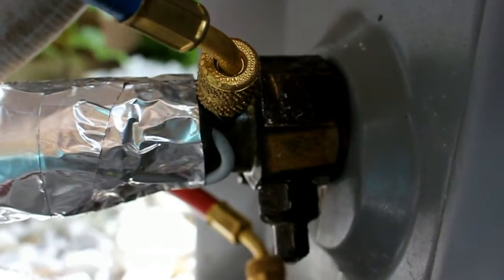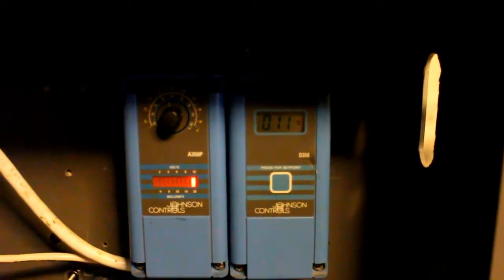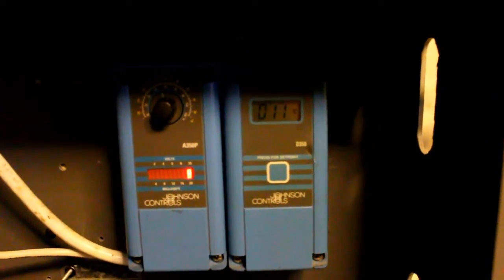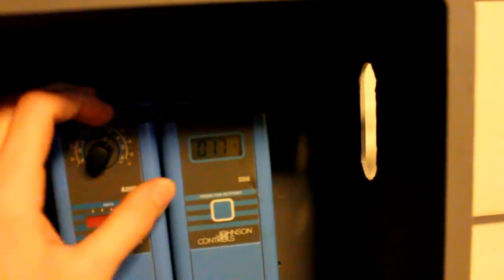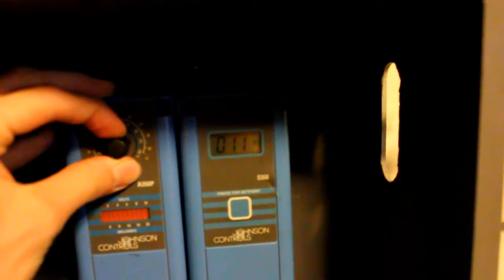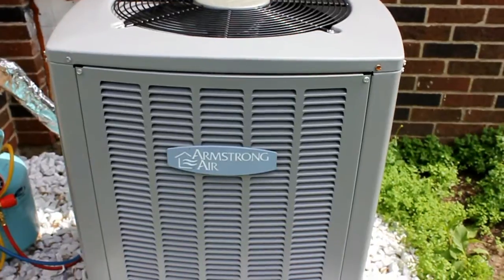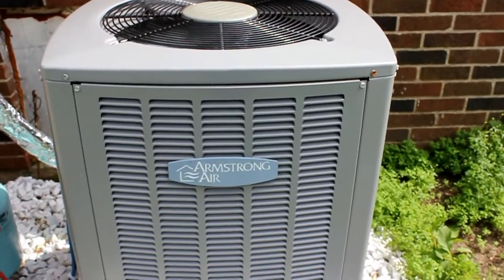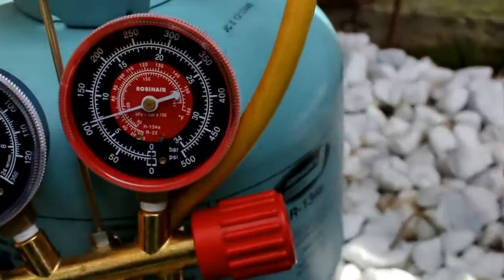We're still sweating all the way back — it looks pretty good. The temperature sensor probe on the suction line is reporting 11°C. So when the compressor is at full speed, the superheating goes up and the subcooling goes down, which is pretty normal. I'm going to turn it back to the normal setting now — we don't need it running at full output all the time. Get it back to 14°C. So that's the heat pump: it's a 310 heat pump with a variable speed compressor — a reciprocating compressor with a variable frequency drive — and R-134A. Seems to work no problem.